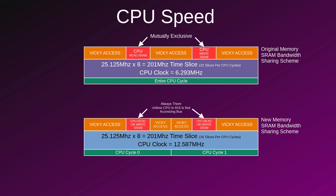Now, in the new core, for the same number of slices the CPU would need 2×4 slices at all times, considering that I would do a read in one and a write in the other. By doing so, I would now use 25% of the bandwidth, which at first seemed like a lot. But considering that the new generation of products all have a 16-bit wide bus for the SRAM, in the end it would not make any difference for Viki. Actually, having a 16-bit bus would allow for really cool feature improvements on the graphical side of things, which I will talk about later.